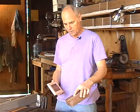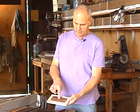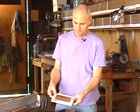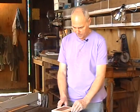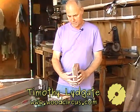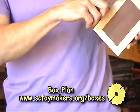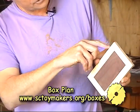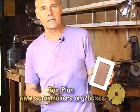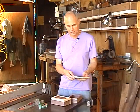We've glued the four sides together, built the bottom, glued it into the rabbet, taken our lid center panel and framed it with the maple — all nice and tight. Now we're going to cut the splines. Splines are these contrasting color bits — basically a slice right through the wood, so there's a triangle of wood buried in there. It helps hold the miter together, because the miter is a great joint but doesn't have a lot of strength if you whack it.